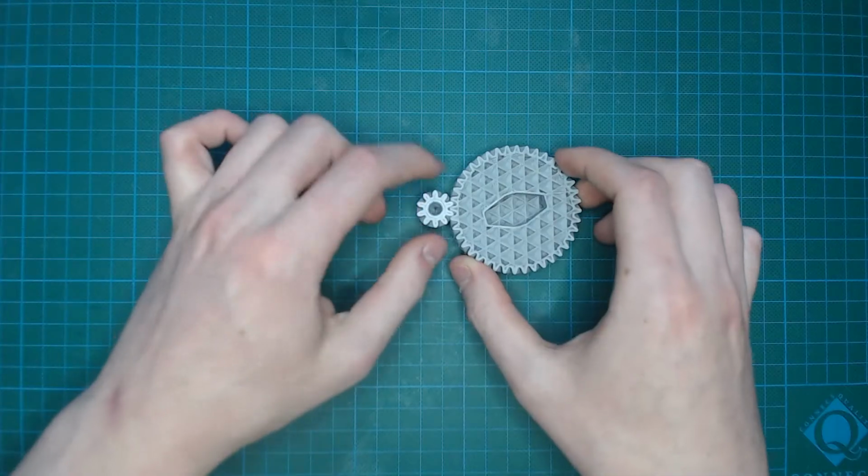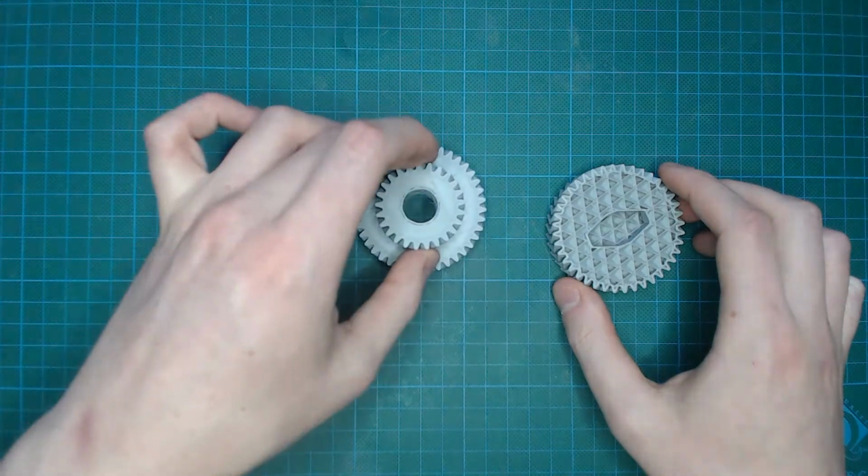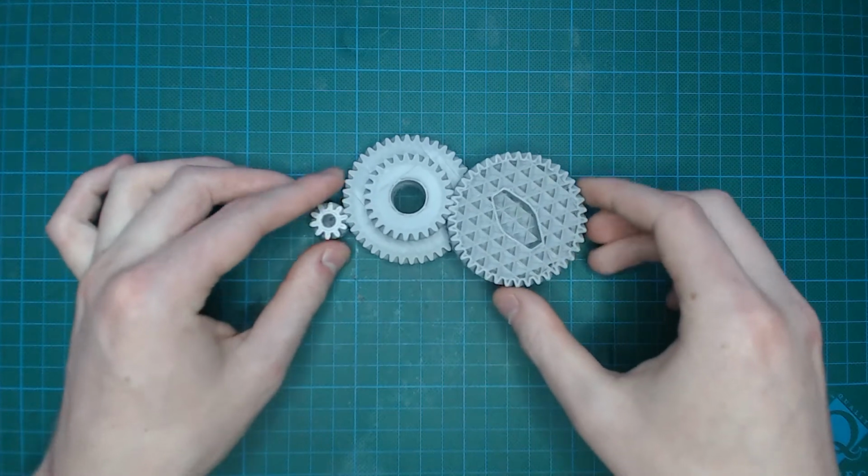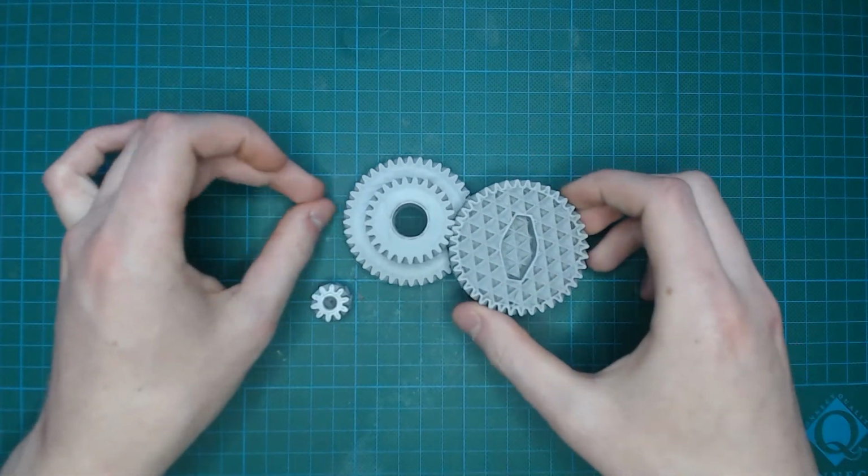Using the bevel gears, I was allowed to have the motor positioned vertically and pressed with the side of it against the gear. However, with herringbone, I would have to have the motor positioned horizontally instead, pushing into the edge of the gear. This means that the positioning of the motor would be a little off, and so I had to come up with a solution for that. I decided to kill two birds with one stone here by having the bull gear, the pinion gear, and then adding a third gear, which was a compound gear, a two-edged gear that had a larger gear that connected to the pinion and a smaller gear which connected into the bull. This meant that there was a higher gear ratio and the pinion could reach the gear without having to have a much larger gear.